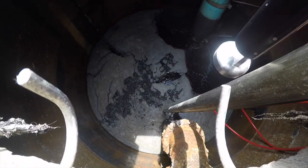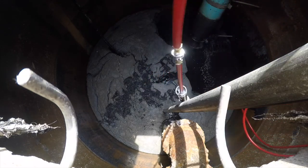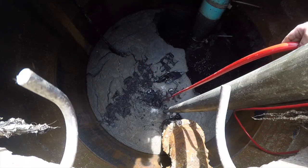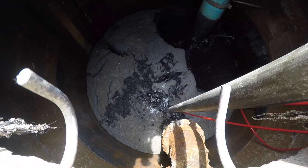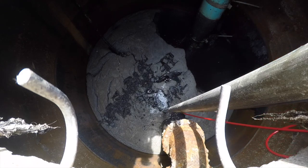Once the cap is sliced, dropping the wizard into place will be simple. It is important to keep the wizards as far away from the pump volutes as possible, and it might be necessary to tie wrap the hose to fixtures at the top of the well to hold the wizards in place. In this video, which is a larger 12-foot wet well, 2 wizards are required.